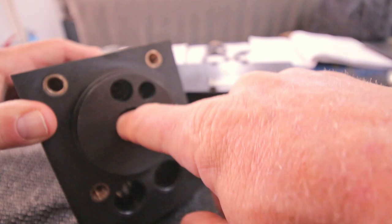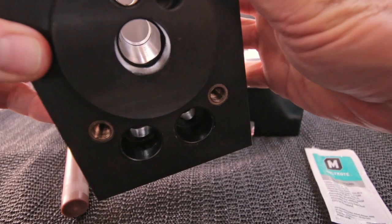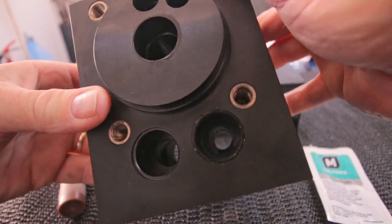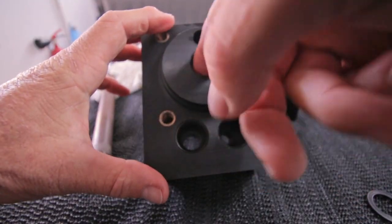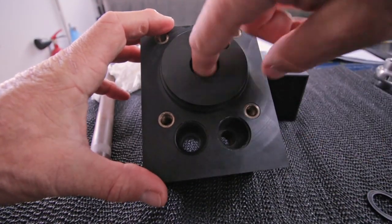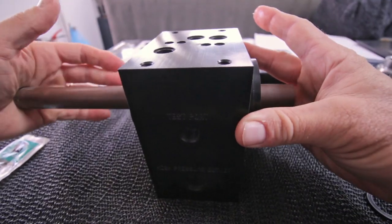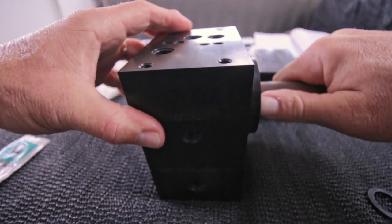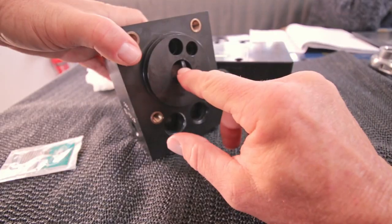I feel it click inside. It's not straight yet. I hope you can see it. See? Try to work it a little. Now it's good. So for the other side, we better push in the rod via the other side, because otherwise you're gonna push against the seal. And when I do it like this, it's easier. So, and now we do the same at the other side.